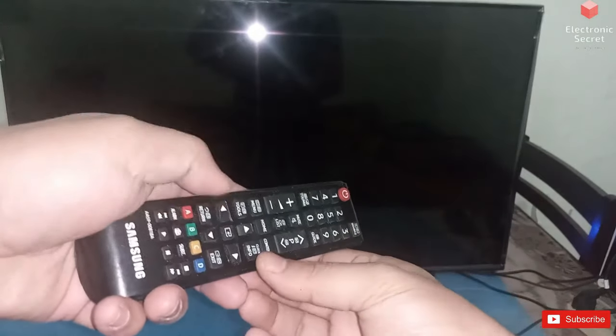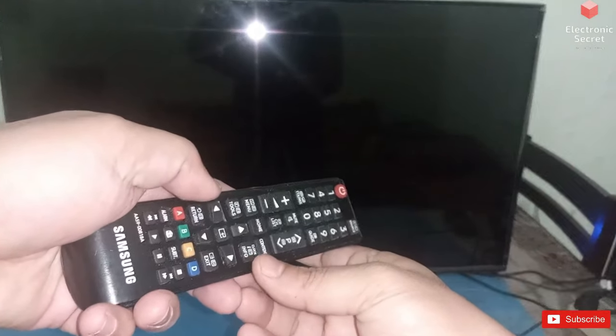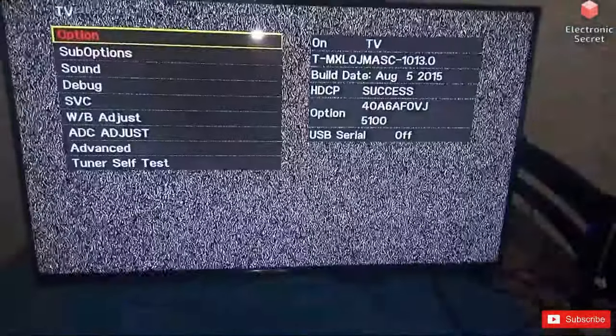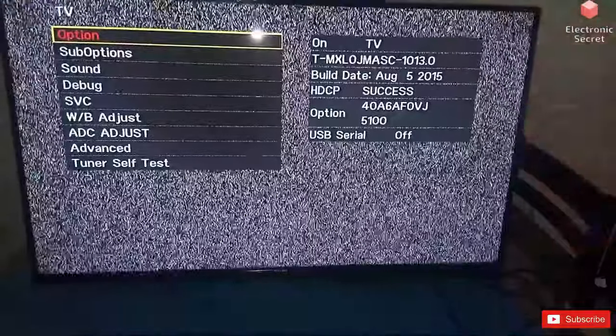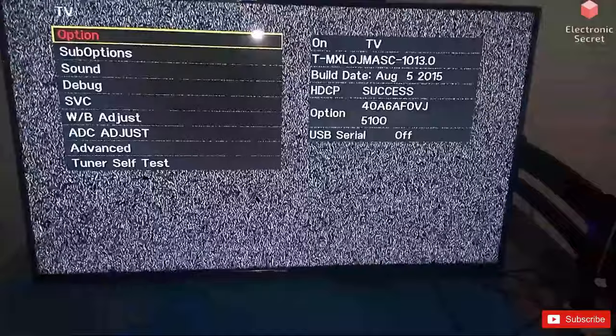Now put the TV in standby mode. Press the following key combination without any pause from the remote: Info, Menu, Mute, Power. The TV will power up and display the service menu. Depending on the model, you will find the factory reset or flash reset in the option or sub option menu. For this model, I will open sub option.